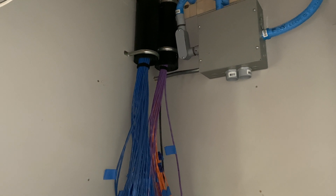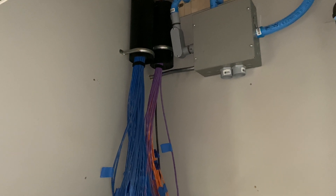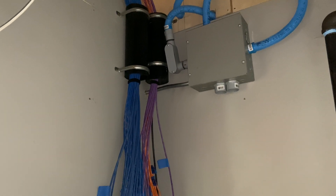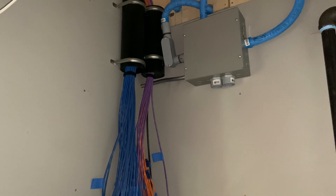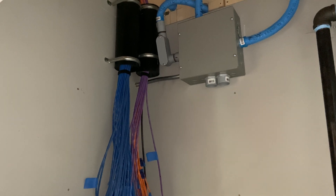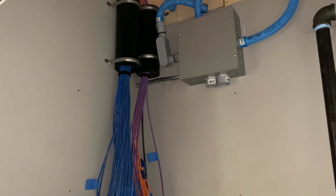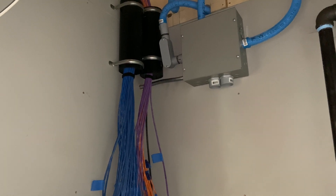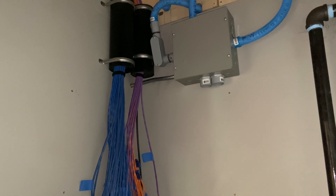The thing you don't want to cheap out on though is copper. You go on Amazon and you'll find Cat6 thousand-foot spools for super cheap — and it's super cheap because it is not copper. It is copper-clad aluminum. You do not want copper-clad aluminum. It's nothing but pain and suffering. Get copper. Pay for real copper. Thank yourself later. You want 100% copper and solid conductors for the stuff in the walls, not stranded.